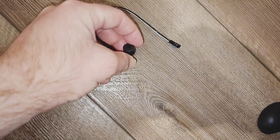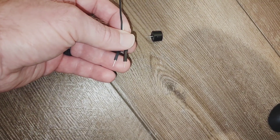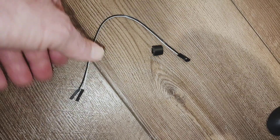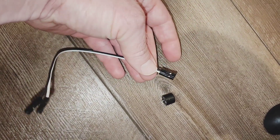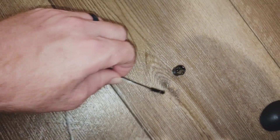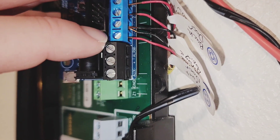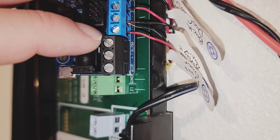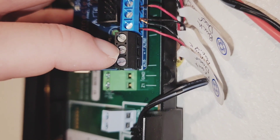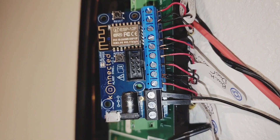Now I want to install the buzzer. It did have a sticker over the top — I already took it off. The panel I'm installing it on has a harness with two wires that go into the screw terminals, and this plugs into the leads sticking out of the bottom. Wires are on the buzzer. You'll see alarm and then a positive. I'm going to put the black wire on the alarm negative and then the positive white wire goes into the middle screw terminal. The buzzer's wired in.